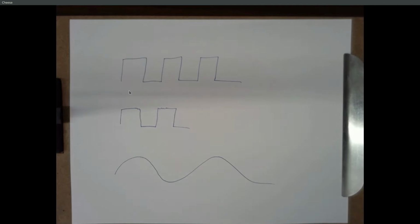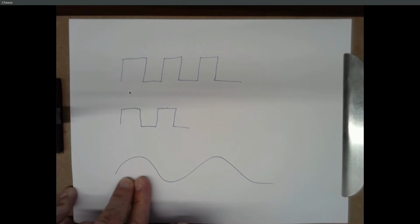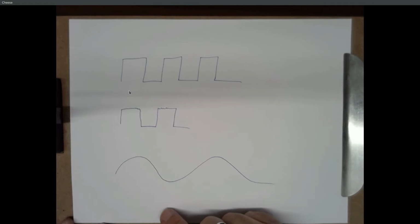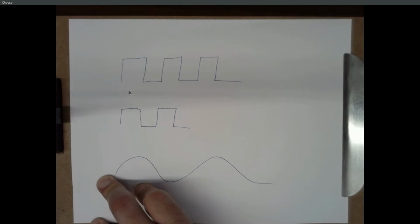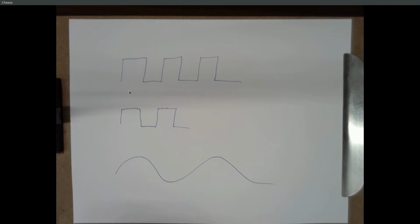The function generator can't actually produce things at this frequency. The oscilloscope can handle megahertz. It can display pretty accurately what's coming in, so this is probably a function generator issue. It needs to drive the voltage up to 5 volts and then pull it down to ground, 0 volts, back and forth really fast, and it's having a hard time doing that. I wasn't sure exactly what I meant by ideal square wave, so when I Googled it, the best resource I could come up with was people talking about how it can't be an instantaneous drop and lift. Mm-hmm. I did cite my source on that, but I wasn't sure exactly what it meant by ideal. So I assumed the little curly curls is what you meant by how does it differ from an ideal square wave, but I'm not sure.